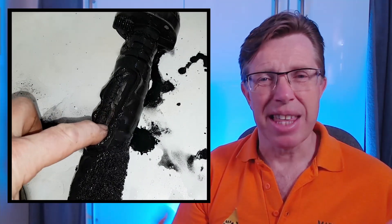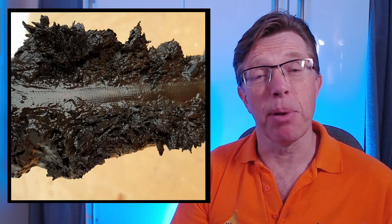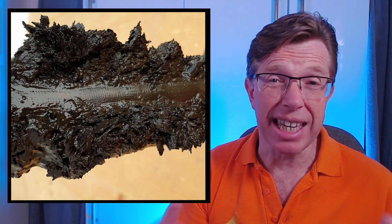How often should you be topping up your boiler? It's recommended between two and three times a year. Any more than that and you start adding a lot of oxygen to your system which is in the water. That fresh oxygen will start rusting away your radiators. That rust then turns into that black sticky sludge called magnetite, which gets washed around your system and ends up in your boiler where it starts blocking things up and making it very inefficient. If you are topping up more than three times a year then it's most likely you have a very small leak on your system somewhere, and you may want to consider calling an engineer.